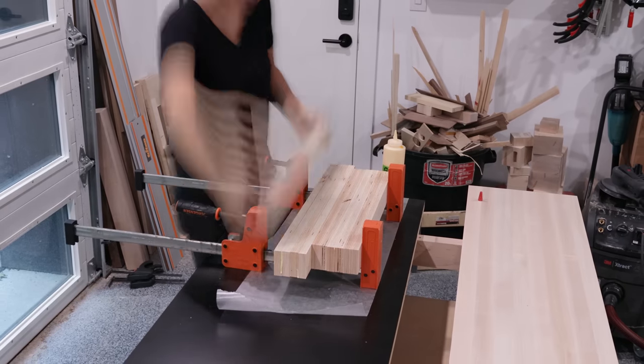I used very little double-sided tape to hold the template down and didn't even replace it after every move, and it worked out great until the end. On the assembly table, I already know where I want the holes — it was all laid out when I was assembling it. I just need to make a center line that the etched center lines on the dog hole template can reference. I just plunge until I can't plunge any further to create the hole. A little tip: before you do the last plunge, just vacuum out the hole — that will remove any sawdust trapped between the bushing and the jig, and your final pass should be nice and clean.